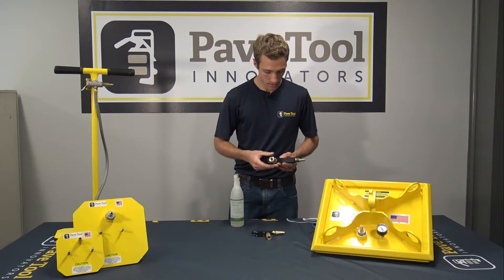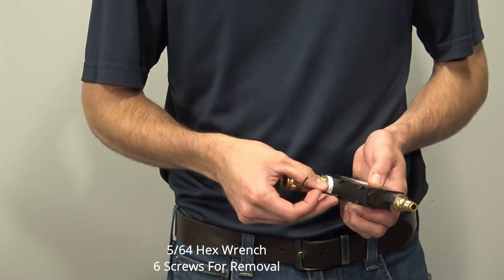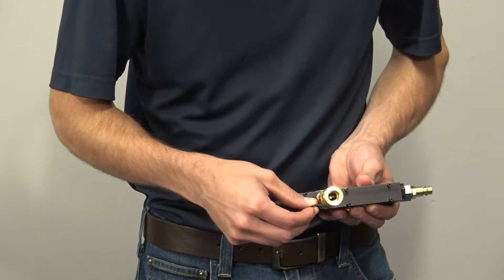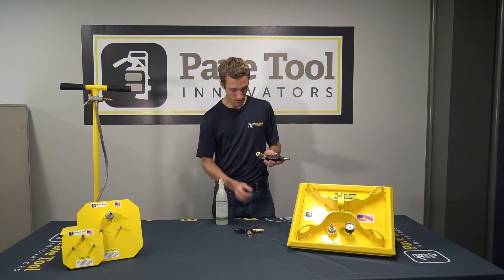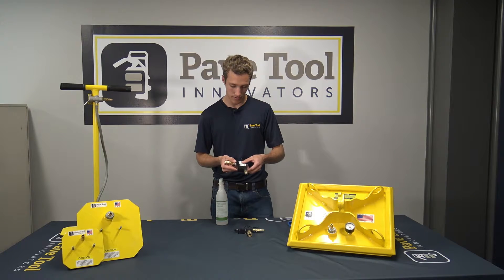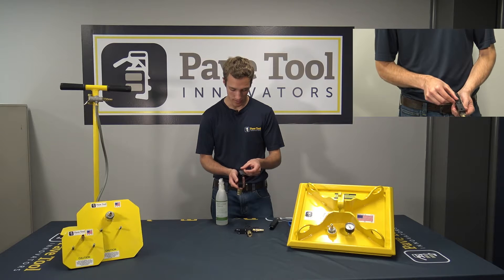This is our HV Venturi. What we're going to do is just take a 5/64 hex head, and all we need to do is take out the six pieces here in the bottom. Once we pull out all six screws, that's going to allow me to break this Venturi right in half — two separate pieces. Also be careful to make sure that you don't lose this inside piece.